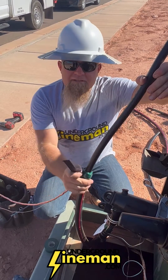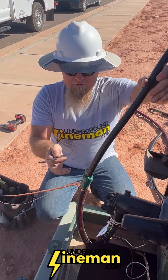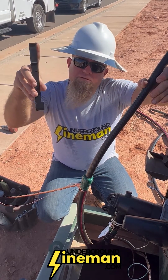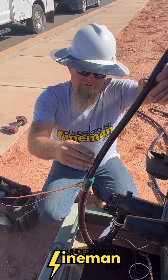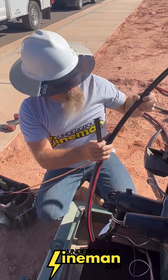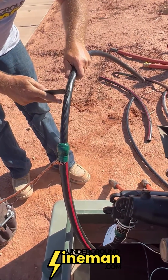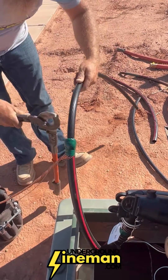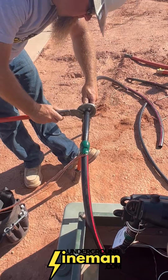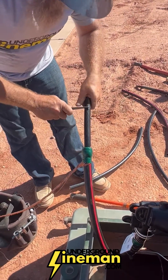Once you have your cable prepped like this, with your mastic concentrics rolled back, take the template and use the fat end. This will give you your two marks for your conductor. Put it on the cable, and then just with a swipe, you end up with two marks — there and there. They just mark on the semi-con.